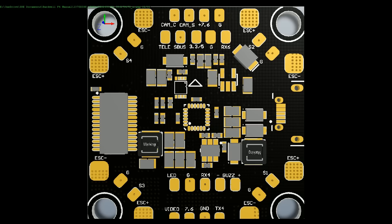That's the goal — maximum filtering from the voltage regulator. If you have a video transmitter that needs 5 volt output power, like the TBS Unify — probably the most popular 5 volt video transmitter — then you're going to need to use either the receiver pad, assuming you're using a 5 volt receiver, or there's a 5 volt pad on the underside of the board. Our thinking is that most people running video transmitters are running at somewhere between 2S and VBAT, so 7.6 volts is going to give the best filtering for the most people.